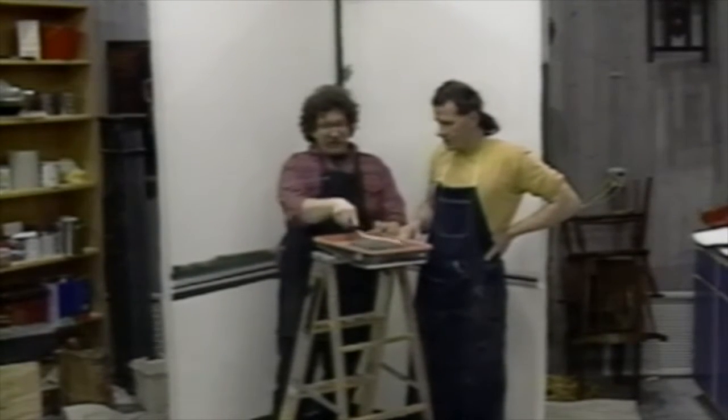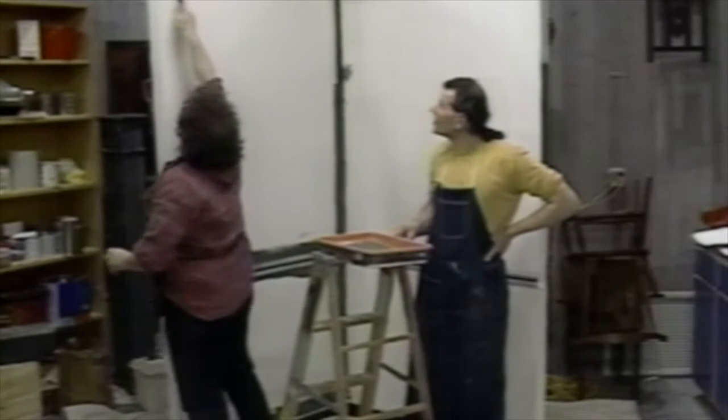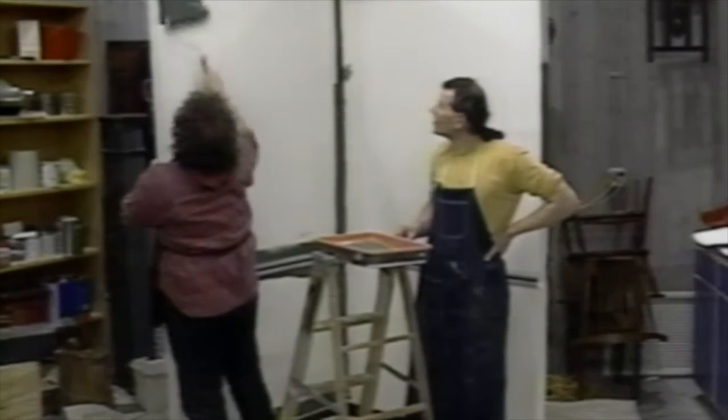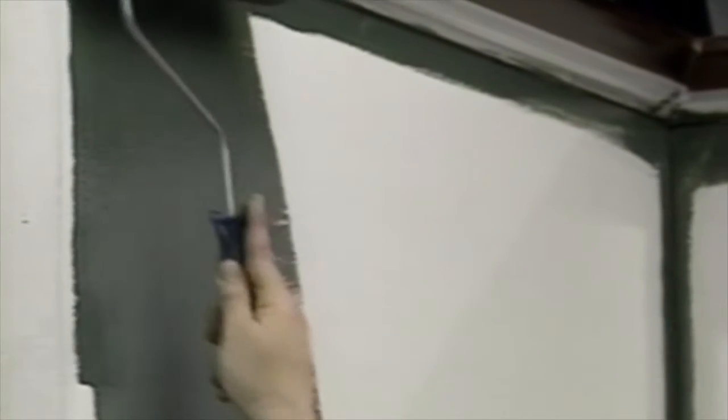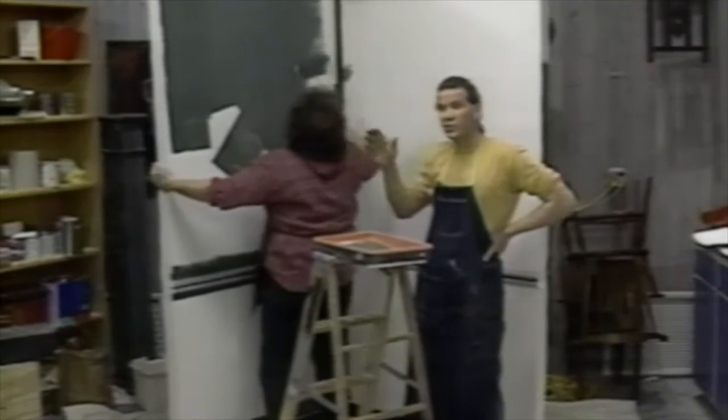Run the comb from the top all the way to the bottom, then go from the chair rail molding down to the baseboard. Now I'm going to roll with the green paint. The paint's got to be applied on evenly because you're going to be pulling this paint down. If it's on too thick it's going to glop up; if it's on too thin you're not going to make any marks.